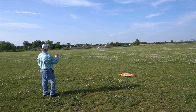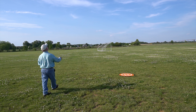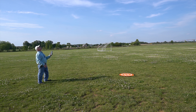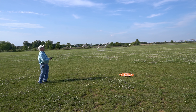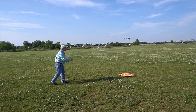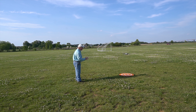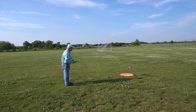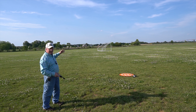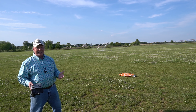When GPS senses it's above the mat it should slow down — already slowing down about 20 feet out, slowly creeping up on the mat. It's almost over the mat and it stopped, making adjustments. It's spinning back to its original orientation but seems off the mat. Coming down slowly, hopefully precision landing will kick in and the picture of the landing mat will help navigate it. It moved a bit — oh come on, this is so exciting — it's close but there's a pretty good wind blowing. It's off the mat, but listen: it was 250 feet downfield, 45 feet in the air, and it came back and almost landed on the mat.